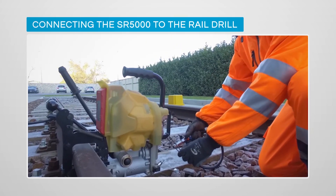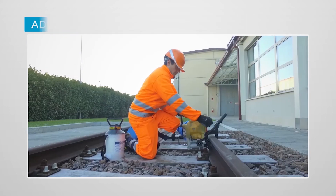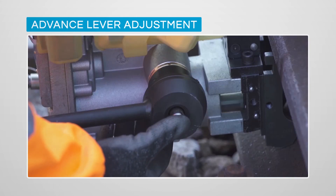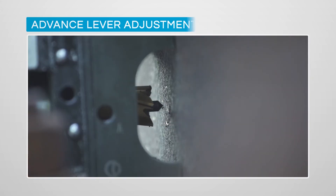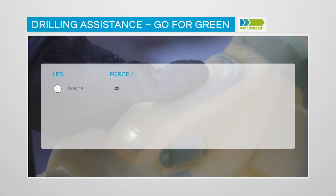When drilling with a broach cutter, the tap is always open; when drilling with spiral drill bits, the tap must be opened before the operation and closed at the end. The advance lever is adjustable depending on operator height or drilling level. Gently touch the rail with the broach cutter by pulling the lever towards your body. When the cutter touches the rail, adjust the advance lever to the vertical position, release the knob and move the lever slightly to avoid the cutter touching the rail when the machine is started.